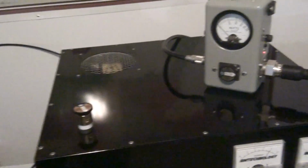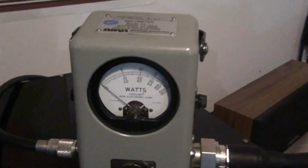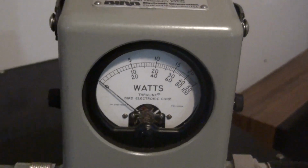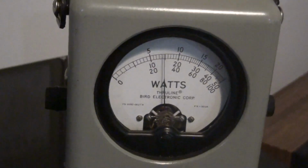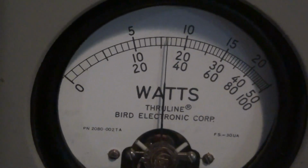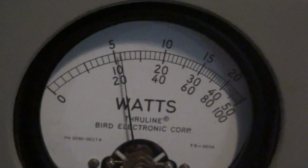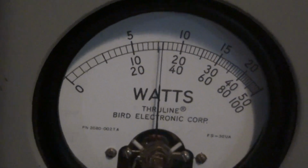That being said, let's get on with the program here and show you output on it. They're a 10,000 watt slug, so we're looking at the bottom scale. That 100 is 10,000, and we are on peak. Audio test 1. That hash mark right there would be 3,000. We're not hardly halfway between 3 and 4, but about 3,200, 3,300, something like that probably.